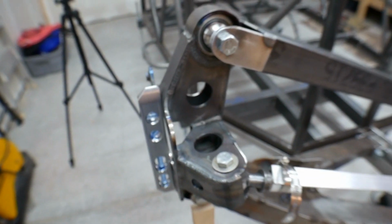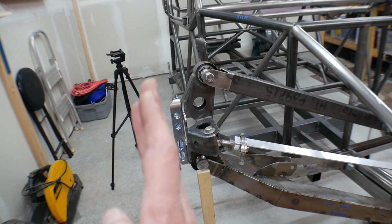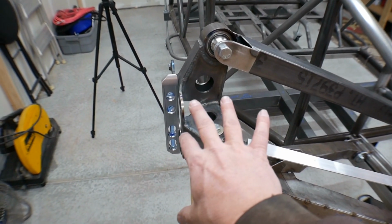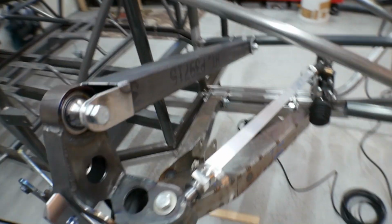But we knew with the geometry that as it compresses, it would actually lean the tire in a little bit at the top. So that's why I dial the camber in at ride height, but I know that it's going to change at full compression. But if I look at it,